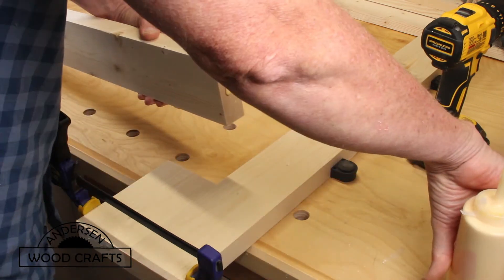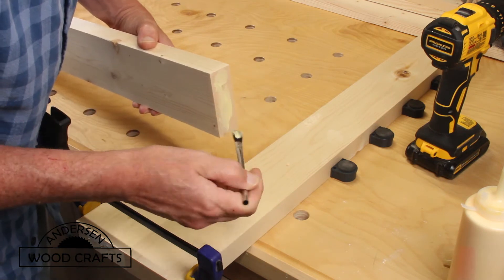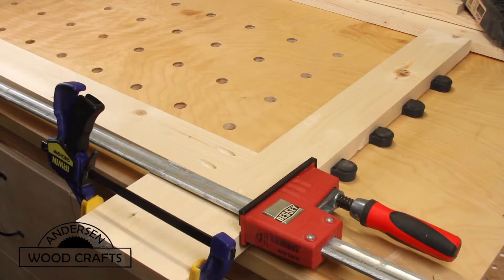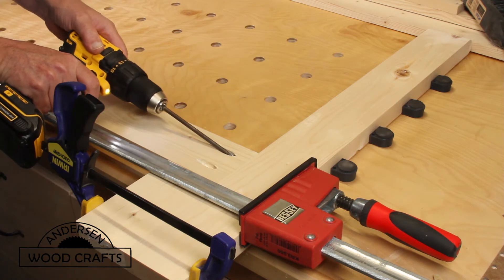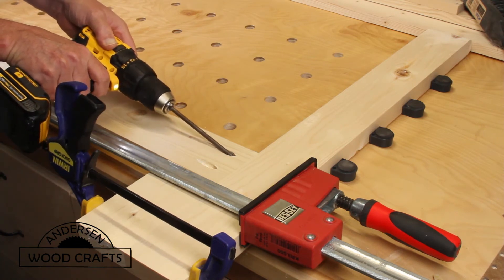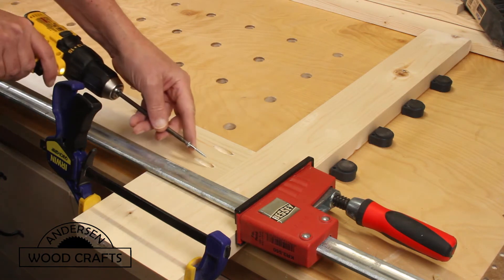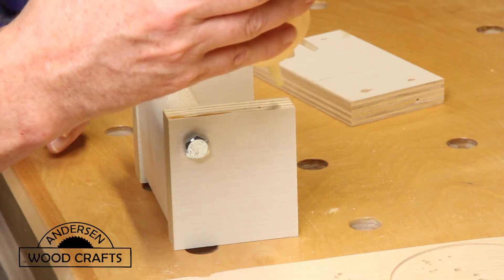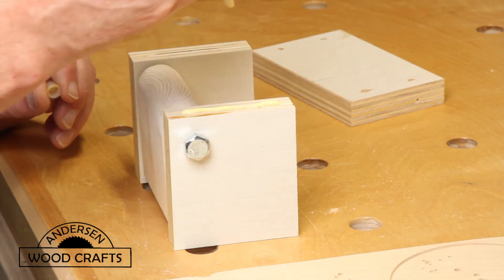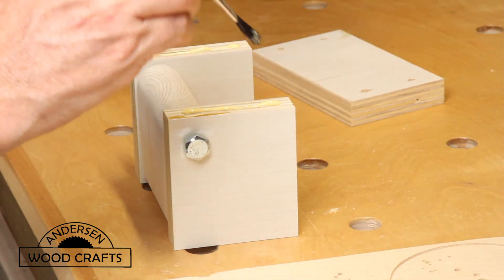A good amount of glue — and since you're gluing end grain, you really have to ensure that there's plenty of glue on there. As you can see, I have a block in there. As with many of my builds, I don't sit there with a tape measure and measure everything out — I use blocks to place things. And whenever I'm driving in pocket hole screws, I always make sure the pieces are nice and tightly clamped before I drive in the screws. In assembling the hinge mechanism, I used a cut off of the leg, rounded it off, and drilled it to use as a spacer in assembling this.